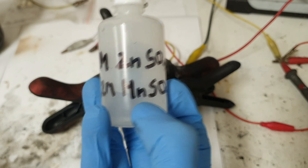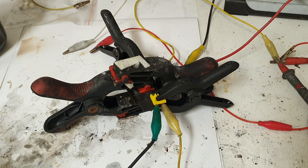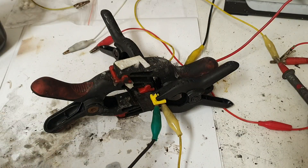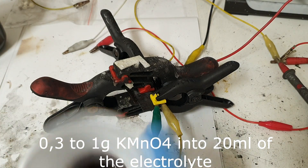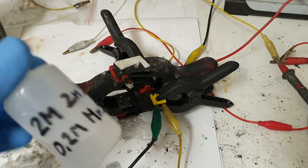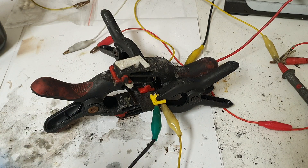As you can see, I added manganese sulfate, and I also added a little bit of potassium permanganate. You can play with the concentration of potassium permanganate in this electrolyte, and you will see what results you get if you experiment with the ratios of the electrolytes. You can create a better supercapacitor this way, but this project is just to give you the idea of how a supercapacitor like this is made. Guys, that's it for now — see you in the next video, bye!